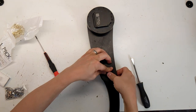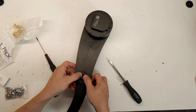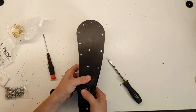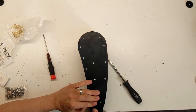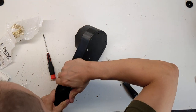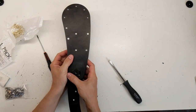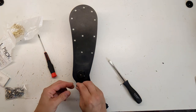Apparently these caps don't even fit in the leg at all — and that cap is in. Pull this back until I can get the bearing to go into the cap — the bearing's in that cap. Now the pre-tensioning operation will be bending this while putting this cap on. That wasn't too bad, certainly a lot easier than before. This is spinning freely; the belt is already pretty tensioned, which is kind of what you want, because the tensioner will make it very tight as we use the tensioning carriage.